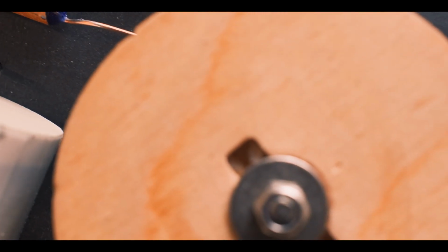We have been taking a lot of care for making the crossovers as good as possible. Means we are doing all capacitors, all inductors in-house. We even make the coil formers for the inductors in-house, made of massive maple wood, which is milled on our own machines, because we found it is much more natural than any plastic former. On the other hand, we are also using proprietary techniques like our inlines, which are reducing magnetic distortions.